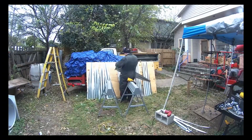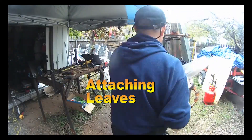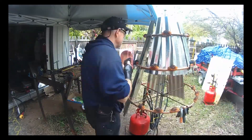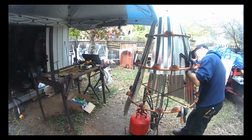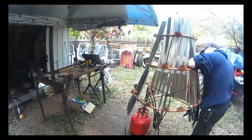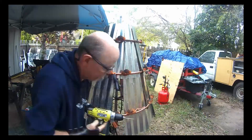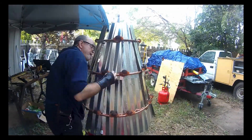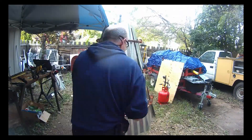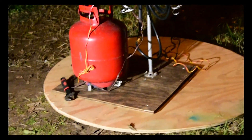I wanted to cut the sheet metal into appropriate shapes, and I used the SketchUp model to help me understand the dimensions. Because I didn't really manage to get the top, middle, and bottom rings all perfectly centered, I used two different sets of leaves. That way the angle between the top ring and the middle ring and the angle between the middle ring and the bottom ring didn't have to be perfect — it also made it look a little bit more like a tree. The leaves were attached to the copper burners using baling wire. I drilled holes, ran the wire through, and twisted it against the back. Everything had to be fireproof. Inspecting the tree before lighting it for the first time, I had to make sure everything was there — the star on top is essential, and the coils made by the electric sheet metal cutter were perfect as fireproof tinsel.